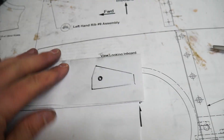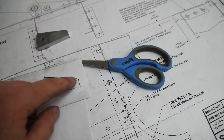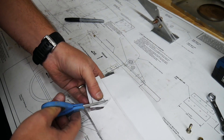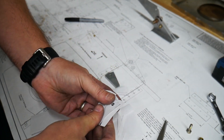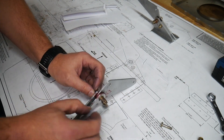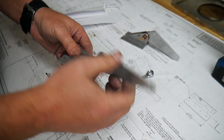What I've done is take a piece of computer paper that I folded four times and traced around the outside of the spacer, then cut it out so I have four shims ready. I'll try it first with just one and see if that fits okay — if it's fine I won't bother with the rest, but they'll already be cut if I need more. And that actually feels pretty good with just one paper shim in there, so I think I'm going to leave it there.